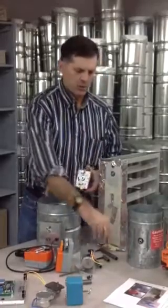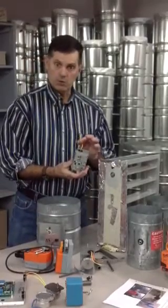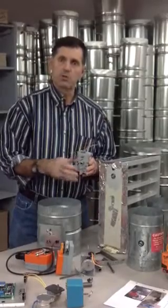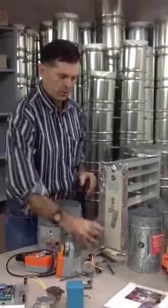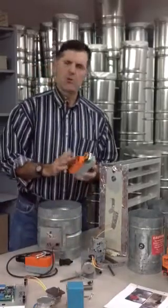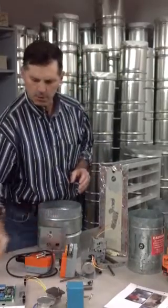We have many different kinds of adapter shafts, so if we can see that — you may also be wanting to convert from a two-wire motor that's spring return. A lot of people are turned off by spring return damper motors because they consume power continuously; they get hot because they're having to pull against the spring that's trying to pull them the other way. On all zone control systems, it's very easy to change over to a three-wire damper motor, which is in all senses a better proposition.